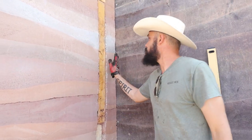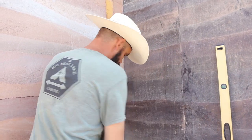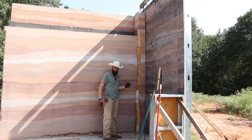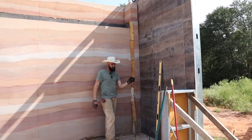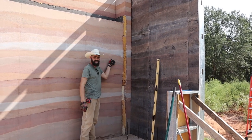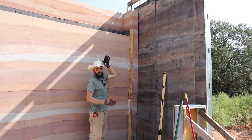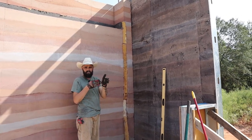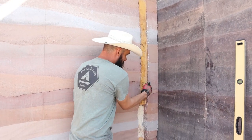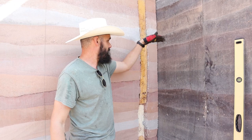What we're going to do is we have this corner piece that will be connected to rammed earth coming out from here going this direction. This corner piece right here is actually going to turn a corner — we're going to have a 90 degree, and then there's going to be another rammed earth wall here that will go to here, and this will be a doorway. The foam up here goes this way and then turns 90 degrees, so we have continuous foam touching all the way through the walls. We're going to take the foam from this wall, butt it right up against this foam here, and then continue it through and ram this corner.